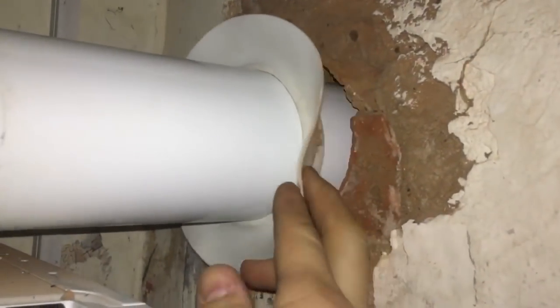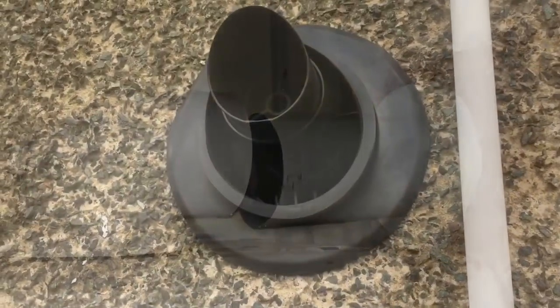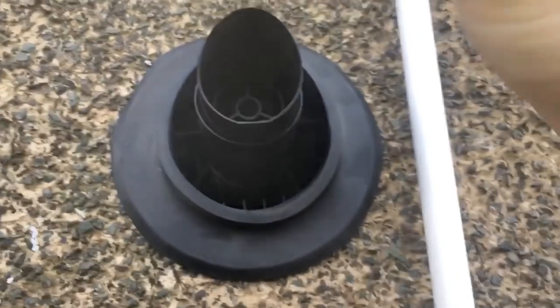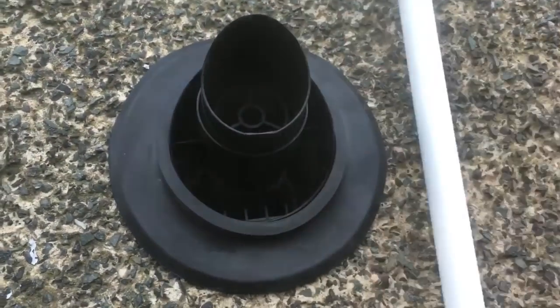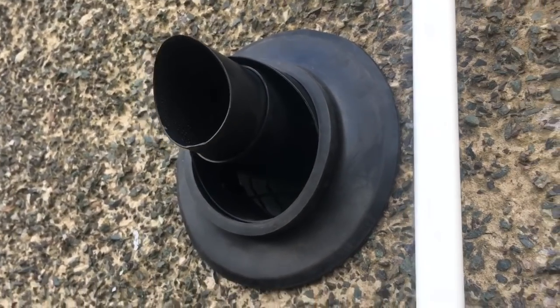So I've checked their manufacturer's instructions on Ideal, and you don't have to seal it, and I just think it's crazy. I mean, what would you do? And the other thing is, they've even cut the flue too short anyway. So that weathering collar could just come straight off, and then you could have products of combustion re-entering the building. I just think it's mental.